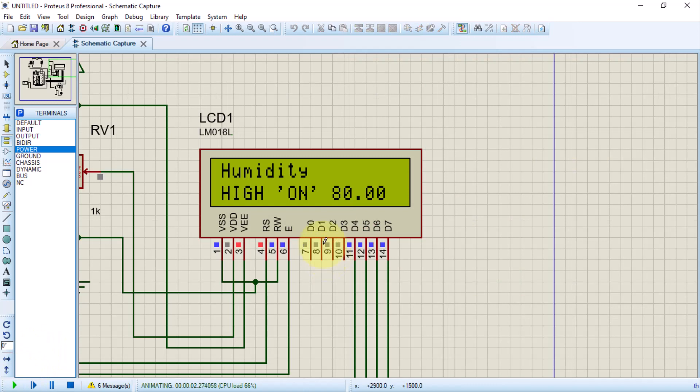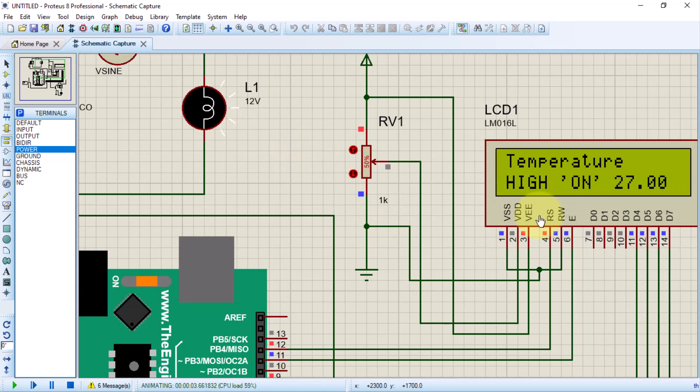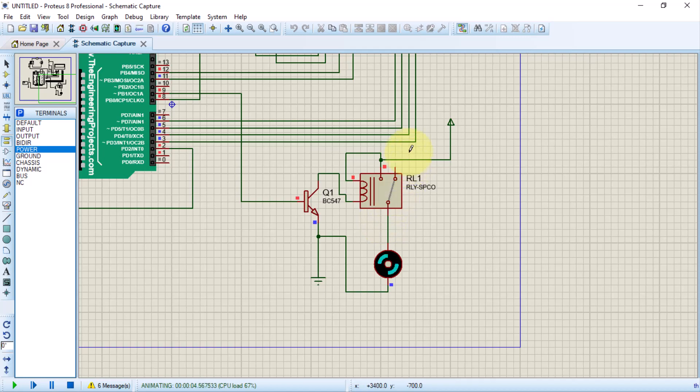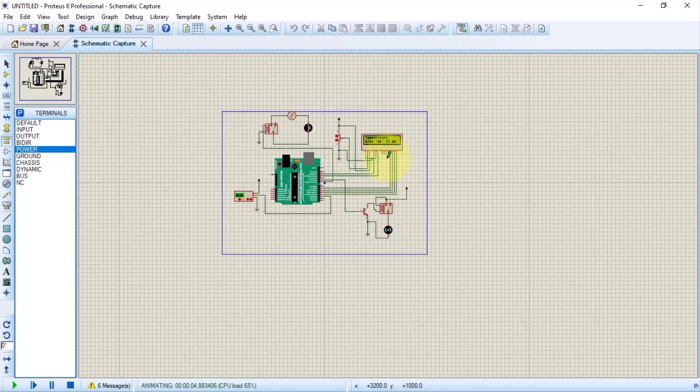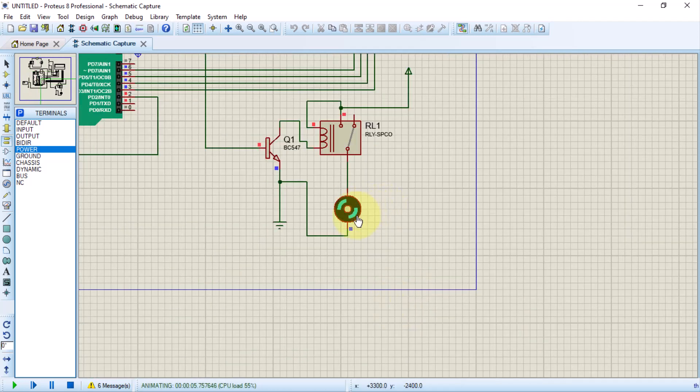Just wait for some time. Good — it's now giving us: humidity is about 80 and temperature is about 27 degrees. The humidity LED is on, meaning the lamp will be on. The temperature is at 27, above our threshold of 25, meaning the fan will be rotating.